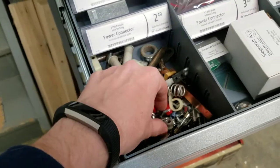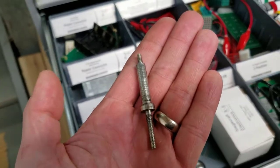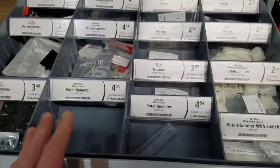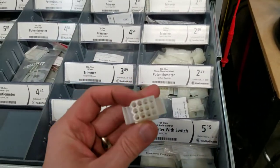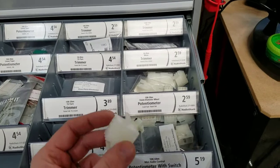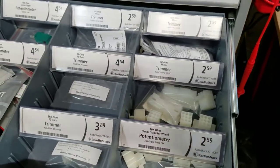For example, if I need a post and one doesn't look very healthy, I can at least have something to stick in for the time being until I order the right part. Here are some more electronic components, including other Molex connectors — things you'll find from the power supply perspective or for back box to playfield connections. I've got some different sizes of 0.093 headers and terminals for those as well, as they use a slightly different terminal point.